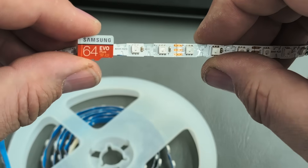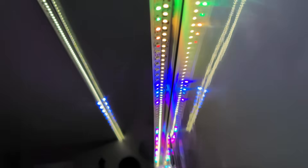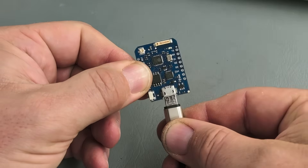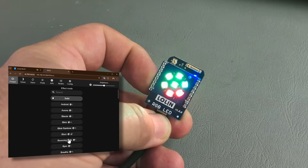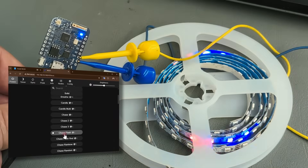So on that same trip back to Canada, I ordered a couple rolls of those WS2812 LEDs on a 6mm wide strip, so they'd fit inside our existing LED extrusions and share the same diffuser as our white task lighting. In my initial testing, I just used an ESP8266 and flashed it with the WLED web installer — just plug in the USB cable, visit the website, click install, and that's it. It's incredibly easy, works out of the gate, creating an access point for you to join with your phone, and within minutes you're controlling lights and exploring dozens of mesmerizing lighting effects.